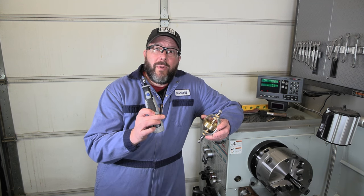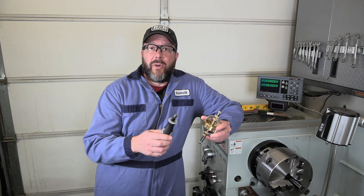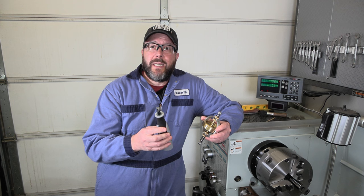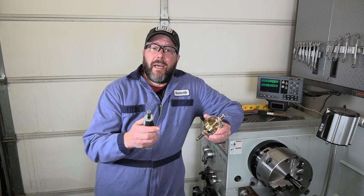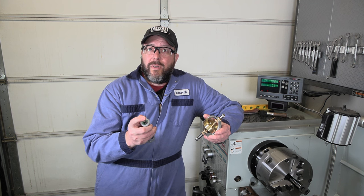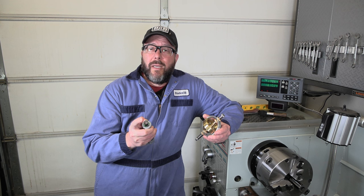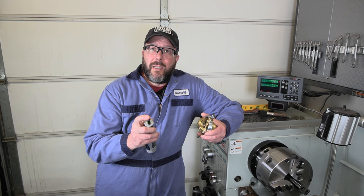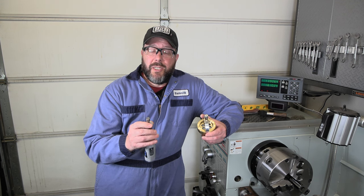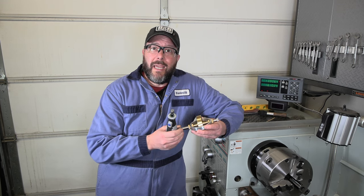And I'm really happy with how this rotary tool works for starting it and powering it. Compressed air is great if you're in a shop environment, but for my son, he needs something portable. So really happy with how this rotary tool worked out. And using the silicone hose, the silicone tubing in there, rather than just the rubber stopper, definitely worked a lot better to make this work as well. A little cleaner and really easy to change if that piece of silicone wears out. Just shove another piece of tube in and make it go. So overall, I'm really thrilled with how this came together.